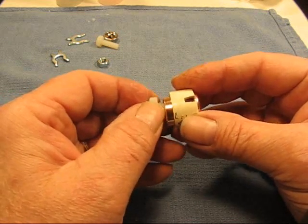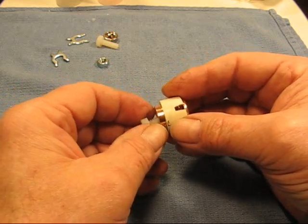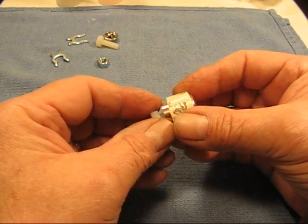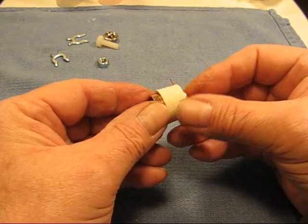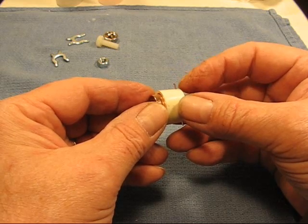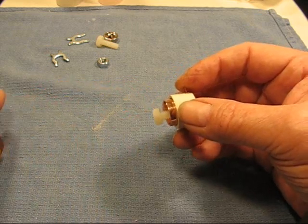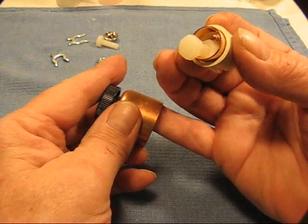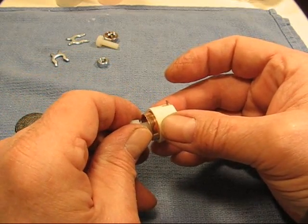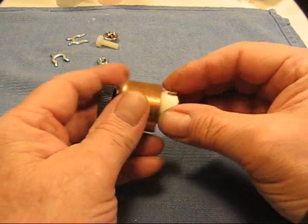This is just a prototype — I'm just playing around with it to see how it's going to work, and I think it'll work great. What I'll need to do is use some braided cloth copper and solder it onto one of the tabs, then solder it up into the inside of the cap so that you do make contact once you start touching.